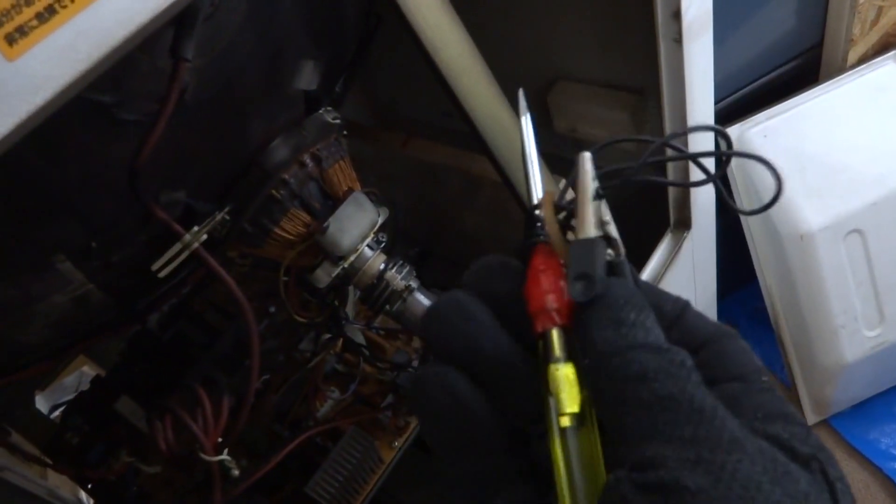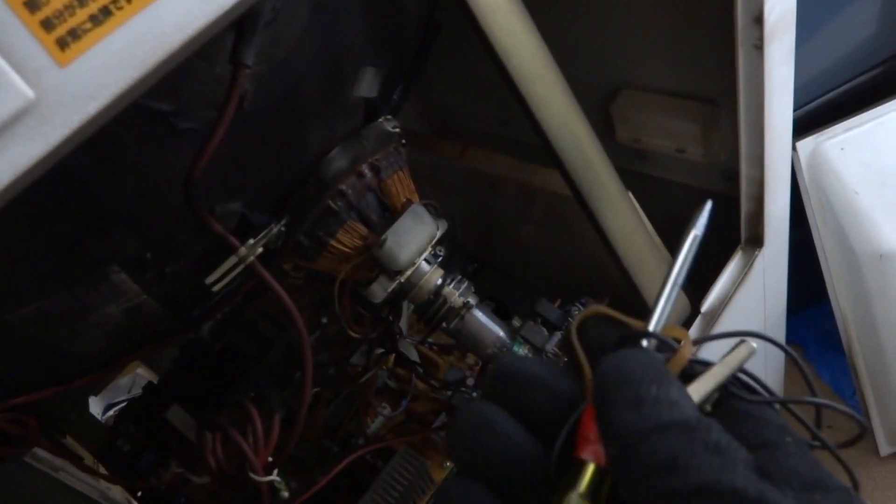So let's go to the next part here, which is removing the monitor chassis. What we're going to do is use our trusty screwdriver with rubber gloves and a gator clip connected to it in order to ground out underneath the cap there. I want to make sure we get a really good connection here.